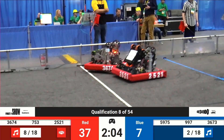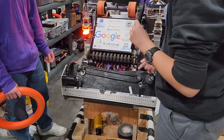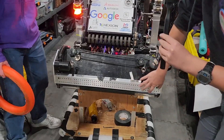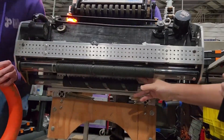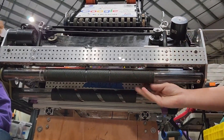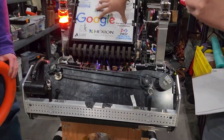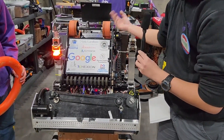So let's start with intake. Nathan, tell us about it. We put a lot of thought into the intake because there were a lot of factors we had to consider and test when creating it — what would be most efficient, what makes the most sense with our abilities. Eventually we decided on an under-the-bumper intake comprised of three polycarb rollers, two of which have cat's tongue grip tape to help better suck up and center notes. Then a third roller in the back helps guide it into this HDPE section, which has two sets of centering flywheels and then feeds it up into our shooter, but it's stopped before hitting these flywheels with a beam break, so that way these have time to spin up.